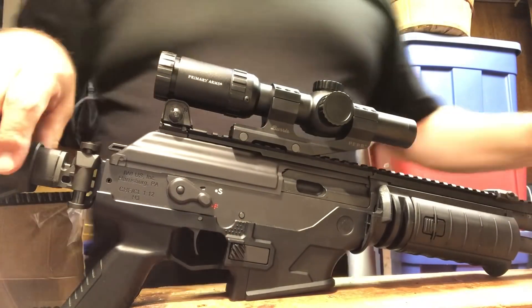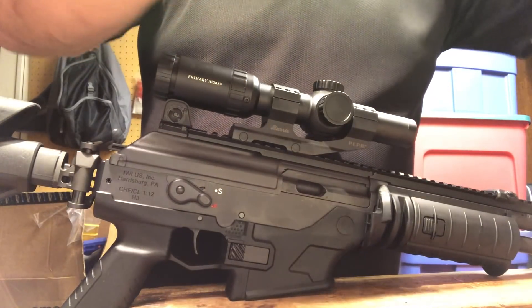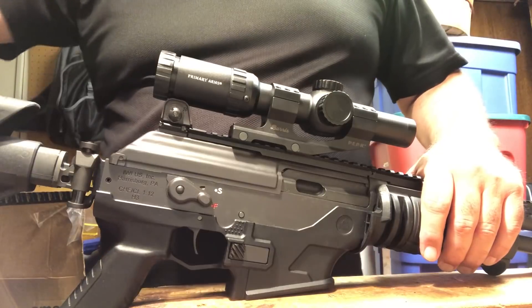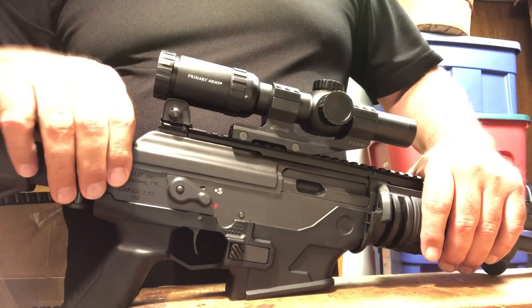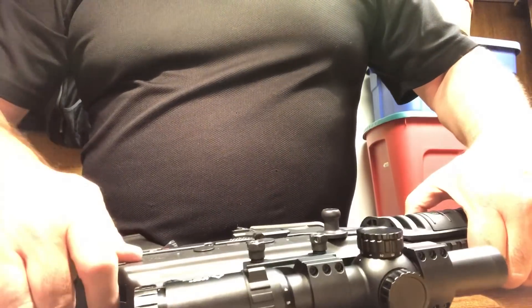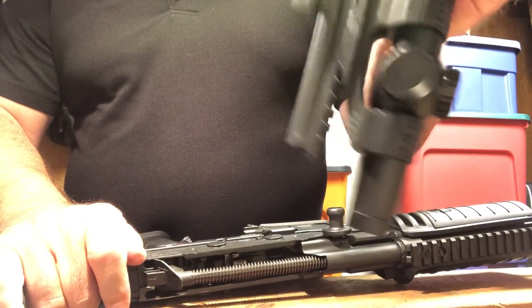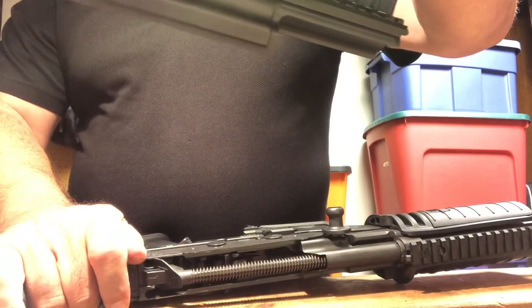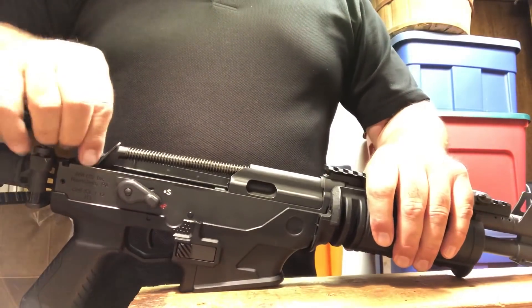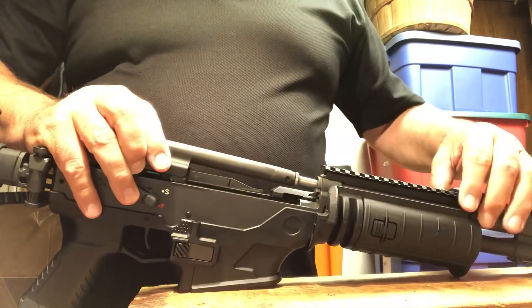The first thing we're going to do is take off the top cover. I found the easiest way to do that is to take a little punch and depress that all the way in there. I've pushed that spring detachment clip in all the way. Now it's a matter of getting this dog off of there — having a little something to grab onto on the top is helpful. We'll go ahead and take out our guts because we're not going to need those for a little while.